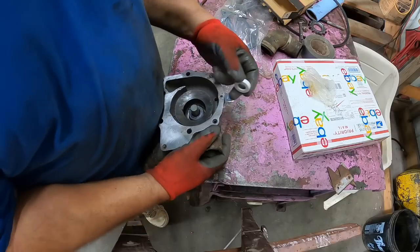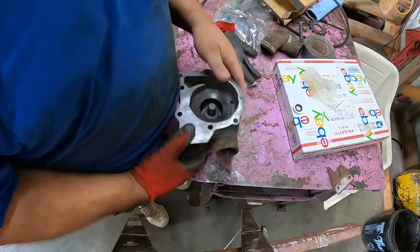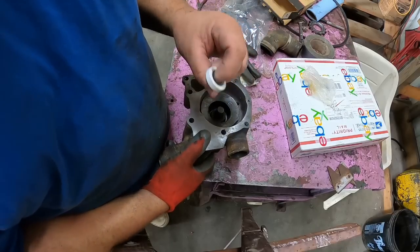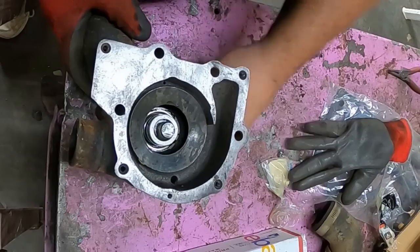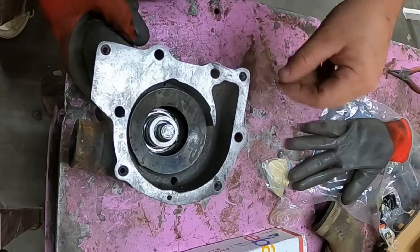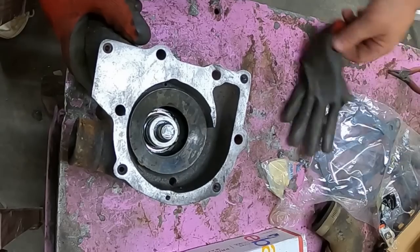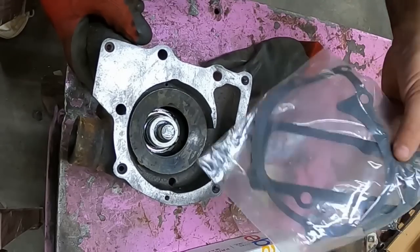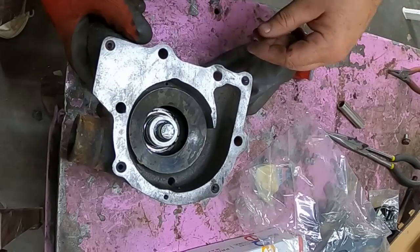And what we've always used is the original lubricant. Get some on there. Well, it wasn't that nice of the battery to die as I was pushing that on there, but it slid right on. So we're back over to the press to put the impeller on, and then we'll have to dope up some gaskets. They feel like they're still pliable. Should be good there.